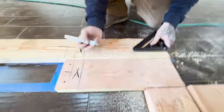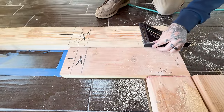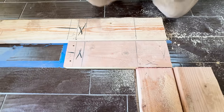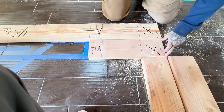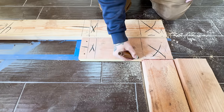All of our channels, any of the ends. That's my thing, man. I can't even see these anymore. I think it's time for a new square. We'll mark out the 5.5 and then just put a big X. We know that we need a Cali here. It'll go from here over to there. That will act as our end stud, and then this will catch our drywall backing. So we'll be 1.5 inches out here, and it'll finish out about there.